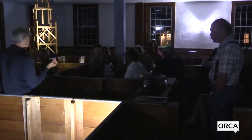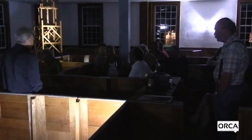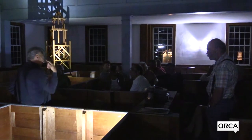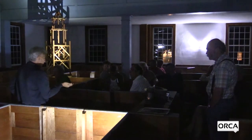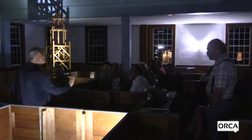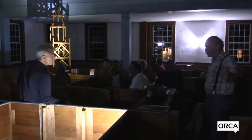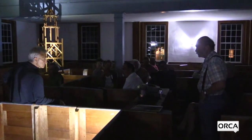The only way you can keep this stuff alive is having lots of air circulation around it. But I've made vertically sawn clapboards before to replace stuff. It'd be interesting to see it on all faces, because usually on the south and the southwest, clapboard gets destroyed pretty badly. On the northeast, as long as it's not a damp northeast, it lasts a long time. It has to do with sun and wind and wind-driven water. But the regularly sawn clapboards that were replacements are on the south side, although the west side was replaced half a dozen years ago.